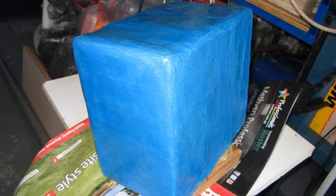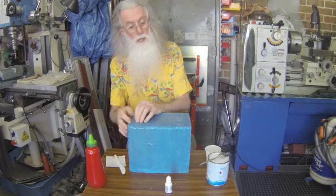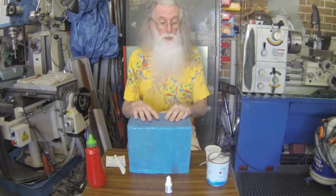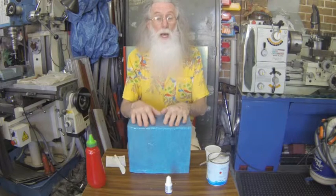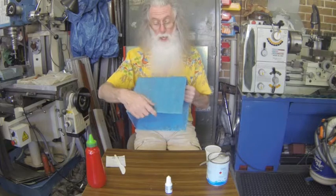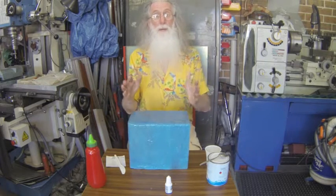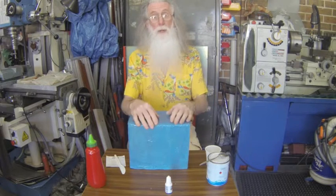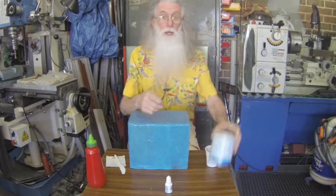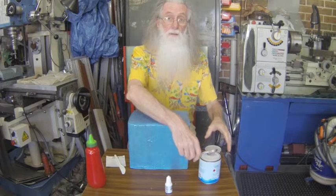You have to do the corners, and as you do it, like I told you, where it's thinner, it'll drop through. So it works, it's waterproof, it's strong, and it's fine. However, if I was to do this again, perhaps I would just take the cloth and make up a proper form out of wood, square corners, all that. Spray the inside first with Flowcoat,